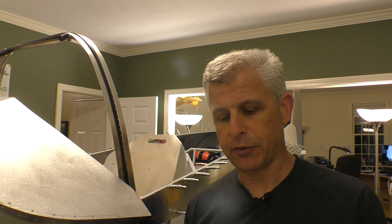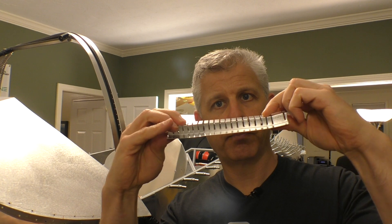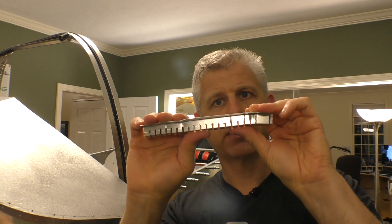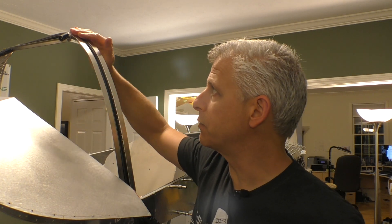It's really amazing how versatile these hat sections are in the build of this Mustang. By cutting slots in the hat section, we're able to bend it and have it actually contour around — and that's exactly what it's done up in this section, following the curve.